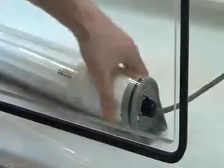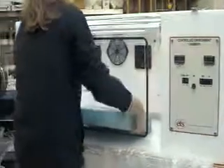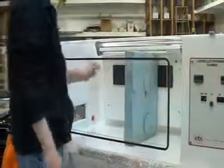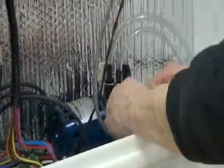Once you see a good solid bead of the O-ring going around, it's tight. Then tighten the compression fitting again — give it a firm turn. Start feeding the wire back through. Remount the light using your pad, push the cable back through, and hook it on the screws and nuts. Come back inside, connect your wires: black goes to red, blue goes to white, and green goes to green. Then cable tie it back down.